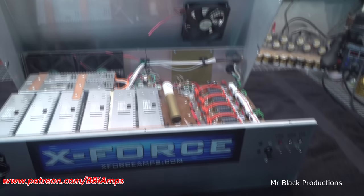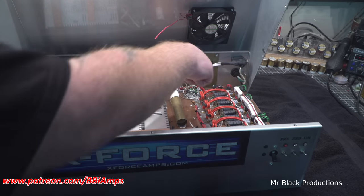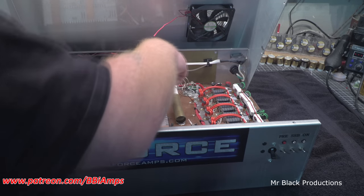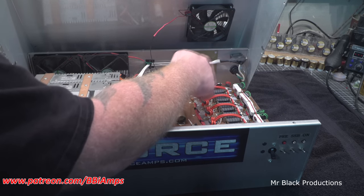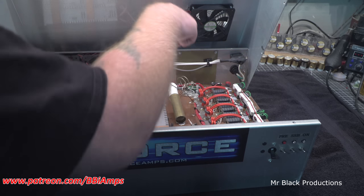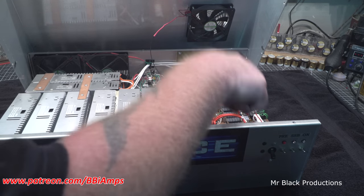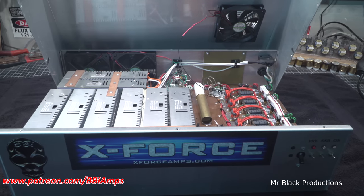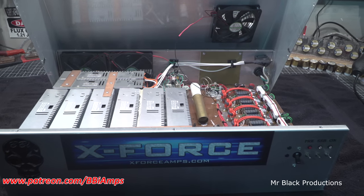And then on top of that, the way they've got the heat sink set, the heat sink stops back here on the cabinet. And so the whole back quarter of this thing was wide open. What we did is we took this all apart and we put a block in the back of this. So all the air has to go through this highly restrictive point and flow out the back. There's a lot of these boxes out there running with this case design. And they work. And they've been working for a while. The cabinet design is bad, there's no doubt about it. But if you don't push them too hard, these things last for a long time.